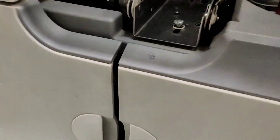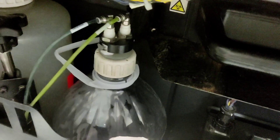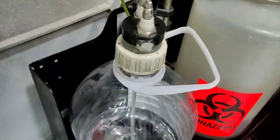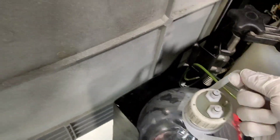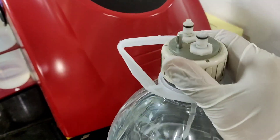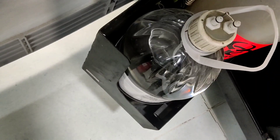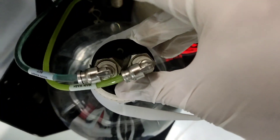We open the door on the left side and right down there we can see the location of the bottles of universal wash and liquid waste. We gently press on the opposite sides of the pipe connectors, as you can see in the video, to remove the black suction cap. Then we take it out and fit the connecting pipe caps into the new universal wash reagent bottle, and put the new bottle back into its own position. We replace the black suction cap by adjusting it to the proper position as shown here in the video — like this. Just look here carefully.